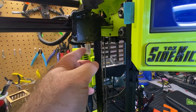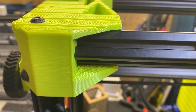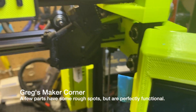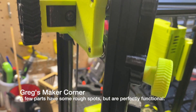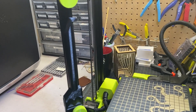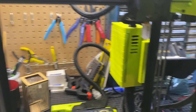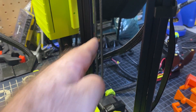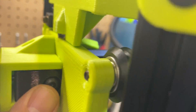You can see where we're going to mount the hot end — there's a BL Touch here. Here are a few close-ups of the parts so you can kind of see the quality. I think it's pretty good quality. I believe it came out of a print farm — there's maybe some poor bridging here and there, but overall it's looking pretty good. You can certainly reprint these parts if needed. Another thing you're going to notice is that all the extrusions are rotated at a 45 degree angle, and all the V wheels on the machine are going at a different angle than what you might typically see — more on the corner, not something I've seen before. And here's the belted Z — two belts that control that, and there are magnets at the top that secure it.